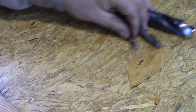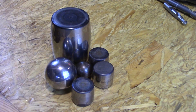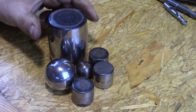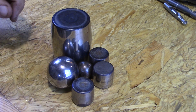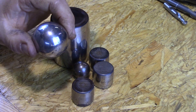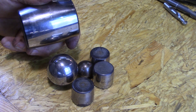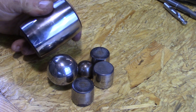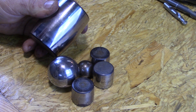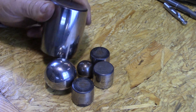So what I'm going to do is machine my own tooling out of a bearing roller. I've done this quite a few times and it almost always works great. If you're not familiar with roller bearings, you've probably seen ball bearings. You may not have seen a spherical roller, but it works essentially the same way — the spherical roller takes the place of the ball in the bearing. The advantage of a spherical roller bearing is that it takes more thrust. You see these in heavy duty applications usually.